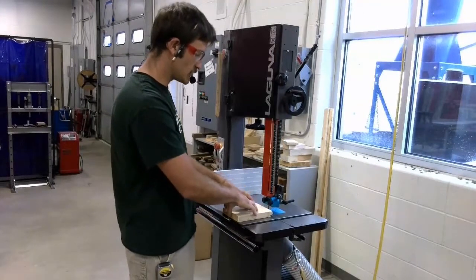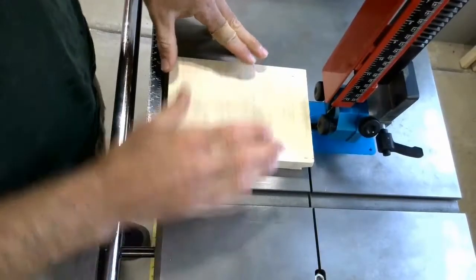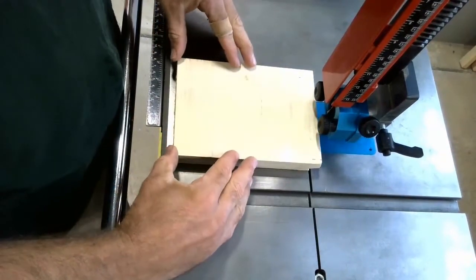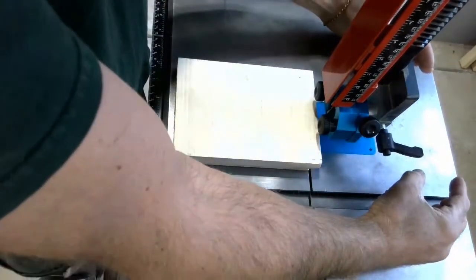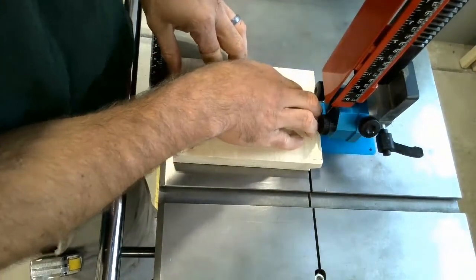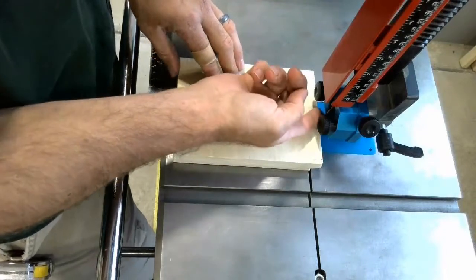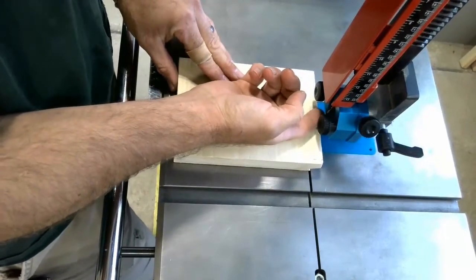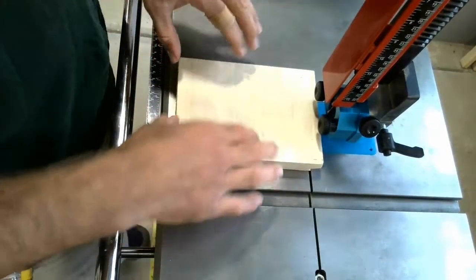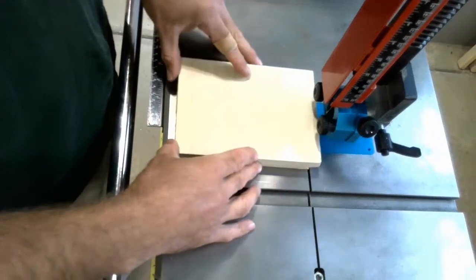Never have your fingers directly in the cut path of the cut you're making. The reason is that as you're making your cut, if you slip and your hands are off to the side, they're simply going to slide past the blade and you're not going to cut yourself. However, if your fingers are in line and you slip, you run the risk of your fingers running into the teeth of the blade. Even though there's not much blade exposed, those teeth are sharp enough that if your finger gets in there, it's going to cut your fingers. So hands will always stay off to the sides, out of the direct path of the blade.